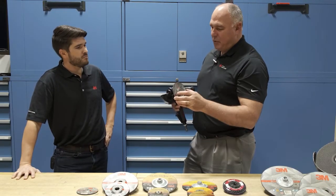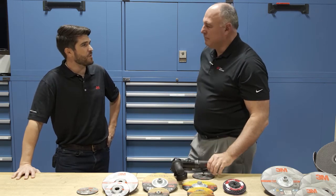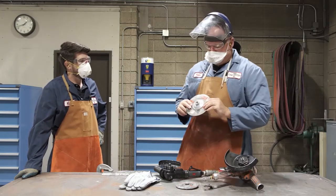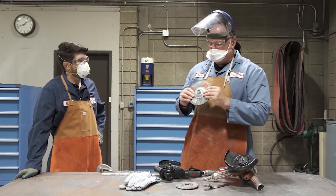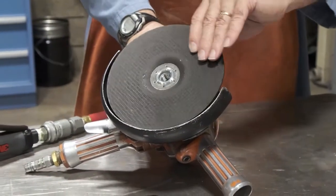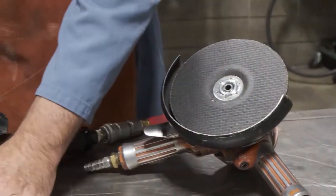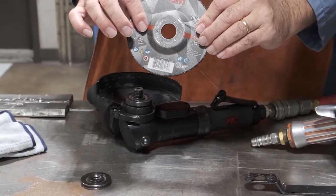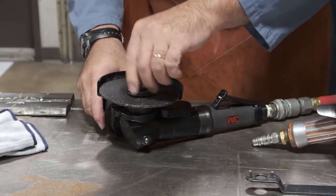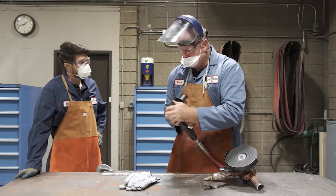Let me show you how to put the wheel on the tool. This applies to our entire right angle portfolio. We have two different attachments. First is the wheel with a hub — it's a 5/8-11 threaded hub that goes onto the 5/8-11 thread on the grinder. You line the threads up, spin it into place, and thread it all the way down until it locks and you're ready to go. For our other wheels, we have a 7/8 center hole with no hub — you line it up with the flanges on the grinder, place the second flange, and lock it into place.